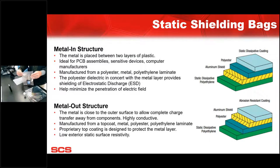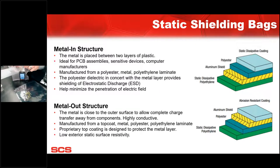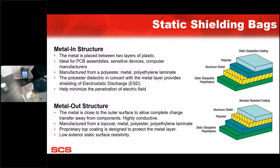So what happens when we put that same measuring device in a pink poly bag? By the standard, you want to put it in the product. You want to fold that over so that you make sure that you're completely protected. And if you'll watch the screen as I engage any type of activity, you're getting readings. I'm reading from behind, but 190 volts, we'll put that up close. 190 volts, we had 33 events that made it through that pink poly bag and onto our sensitive device.